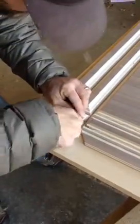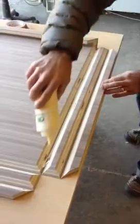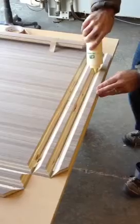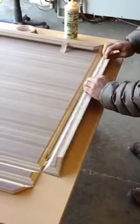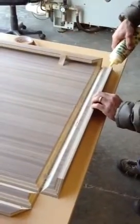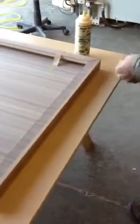You don't have to be real careful — just make sure that you don't cut away on the joint. To glue it up, it's fairly simple. You lather up the joint, get some right down into the apex of that joint, and then just wiggle it back and forth a few times. It will distribute the glue throughout the joint. He's already got that one side — that far side — kind of taped down. Then to work the corners, it's really just finger pressure and clamping tape.